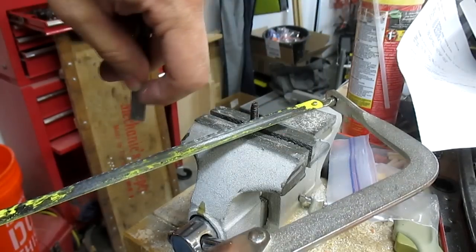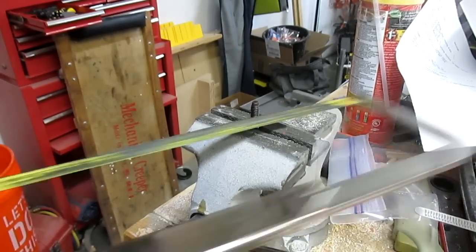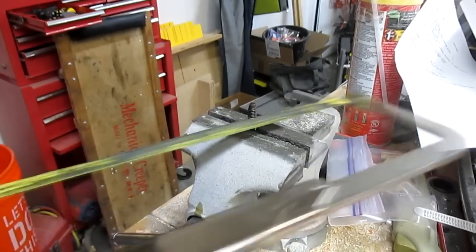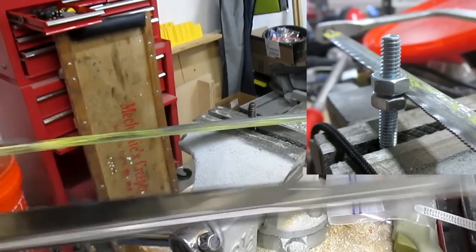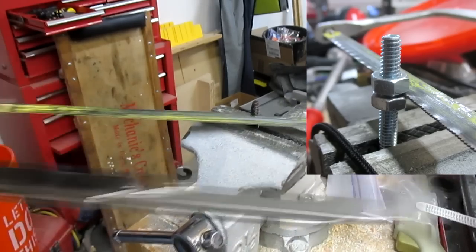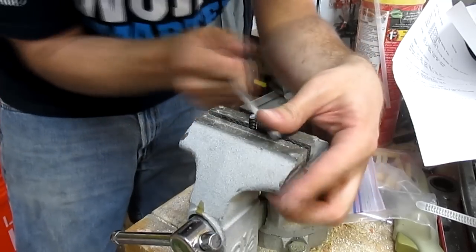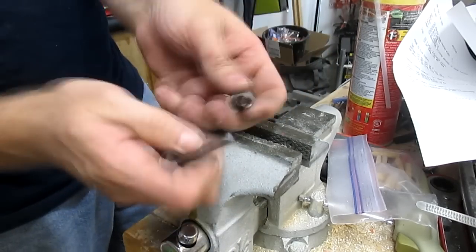I picked up the furniture bolts from Lowe's and had the choice between too short and too long. I used a hacksaw to cut the bolt down to about 1 and 7/16ths inches, but you can also use a Dremel-type tool or a grinder. One good way to cut bolts is to put two nuts on the bolt and then cut between them — this leaves a nut on that will clean up the threads as you take it off. After cutting the bolt to length, I used a small file to clean up the threads on the end, just enough to get the nut on.